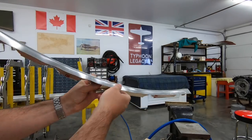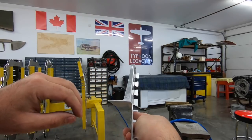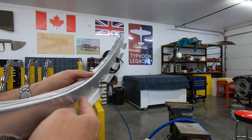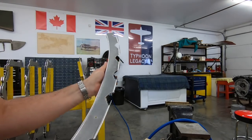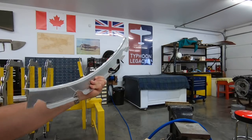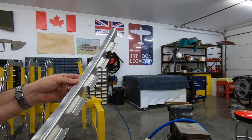In this case it's a little bit over-stretched, which is actually good because of the next move. If you look down you'll see that the web is angled this way now — so there's extra material here, maybe a little bit too much, which is okay; we can shrink it, though we don't want to. The next step is that this flange gets trimmed down, which will take some of it out, and then it's going to get bent back, which is going to require even more stretch on that second flange. So we'll go with what we have and first step is to trim this.